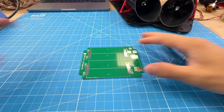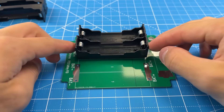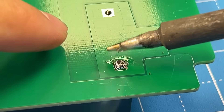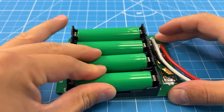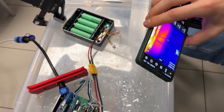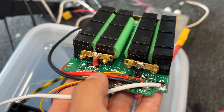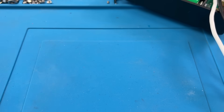The electronics are quite different to what you've seen previously on our channel. The first board is for the battery. I just need to solder the battery holders to it — 1, 2, 3, 4 — and insert the cells. Actually, after recording this clip, we did much more limit testing of the drone, and the battery holders were getting way too hot, so we replaced them with ones that have a better connection.